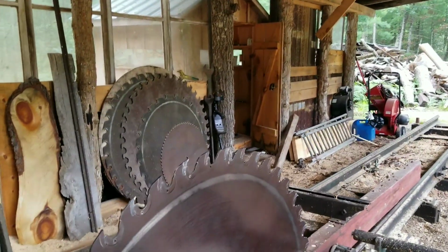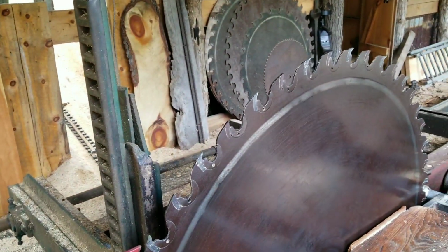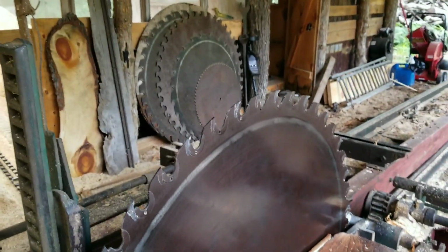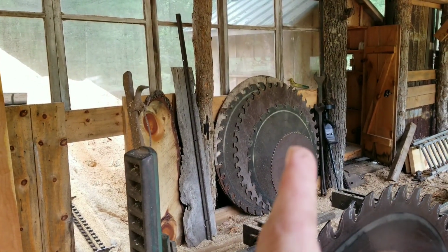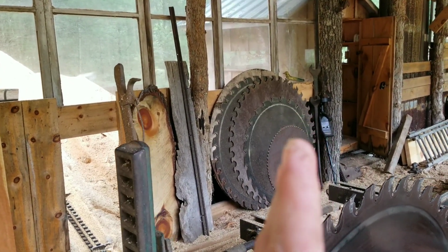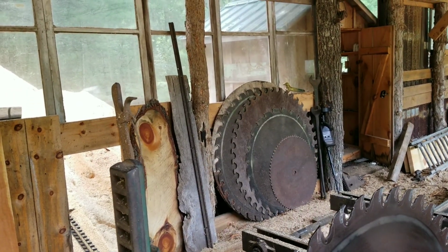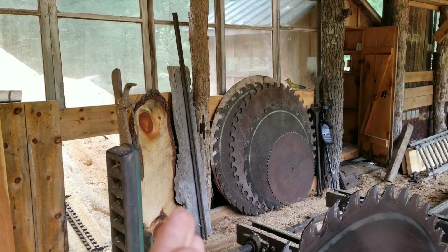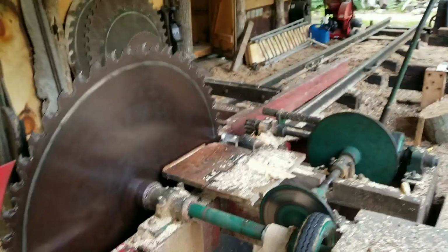So the lead on this is an 1/8 inch off, but this blade also has a little wobble in it, so it's kind of hard to set the lead with this blade. But I do remember when I set the lead with the 48, which spins flawlessly, there is no wobble at all to it, and I had that lead just a hair's difference, because they say the less lead you have, the faster you can cut. And, you know, a 1907 mill, believe me, I'm trying to get everything I can out of it. So, yeah.